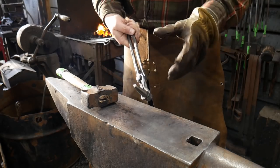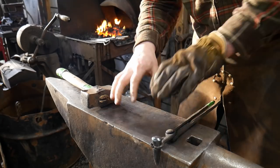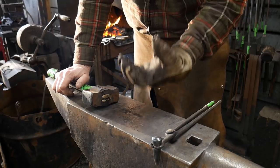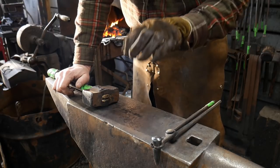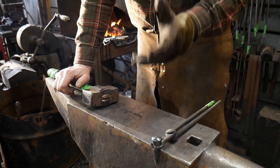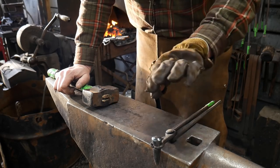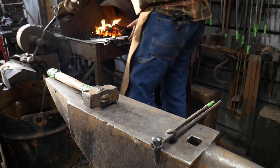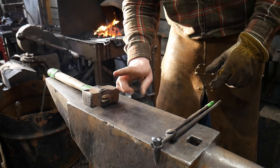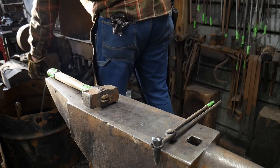Now this isn't quite an eyeball punch that you would see in ironwork as far as making animal heads and things like that. It's more of a concaved punch, round ball punch, and it's made for decorative ironwork, whether it's to set rivets. This particular style I'm making to actually create bosses in the middle of the bar for rosettes and things of that nature. So you guys can check out a video that I just did recently on forging decorative rosettes. I'll link it right here and also put it down in the description down below.